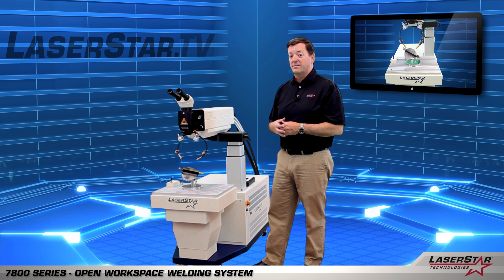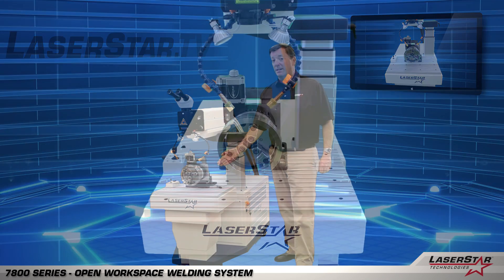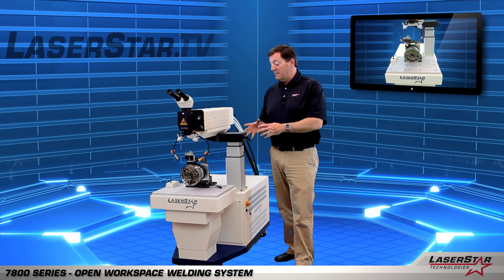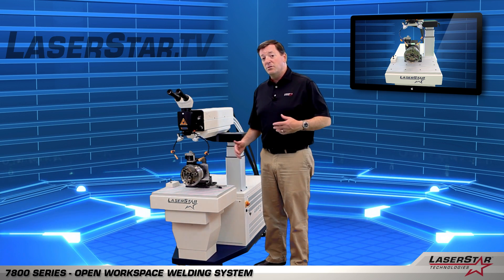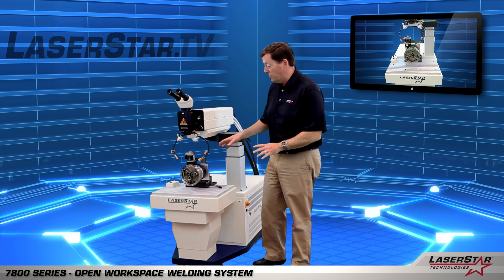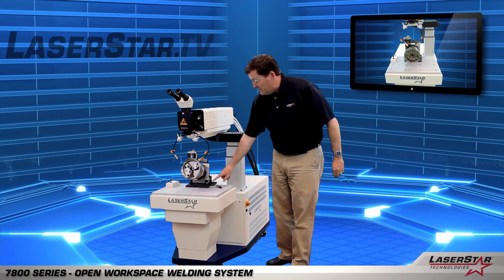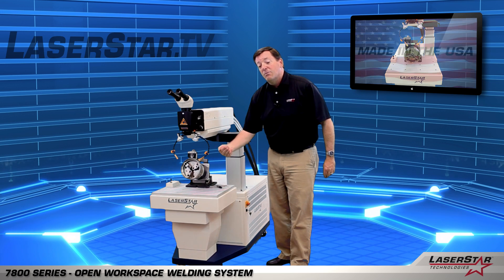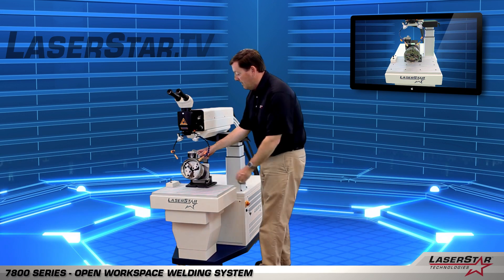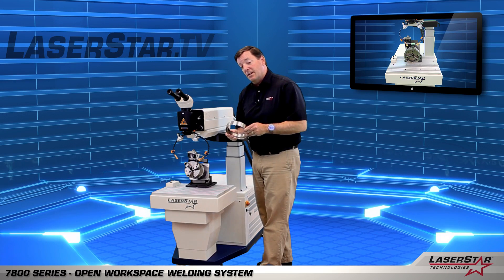Now here we are with our large industrial rotary device. As you can see, this is a heavy duty mechanism with a four-inch diameter chuck that allows us to put large or small parts into the welding workspace. It allows the user to pre-position the fixture, lock it to the T-slot table, and also change the angle by simply pulling this pin, making an adjustment, and repositioning the pin. There is a scale on the side to easily redefine or repeat a previous position. Using the key, you can release the jaws and remove the part after completing your welding or for inspection, then reinsert.